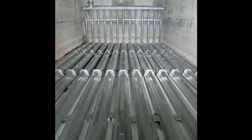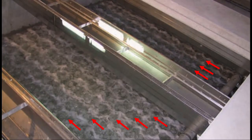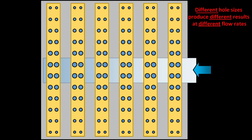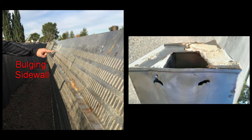Competition's triangular-shaped metal underdrain laterals present three concerns. First, spacing on 12-inch centers that creates large dead zones between lateral lengths. Second, the inherent problem of maldistribution down each lateral in a header-lateral configuration. And third, the questionable structural integrity of 20-gauge sheet metal.